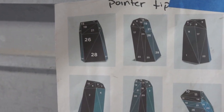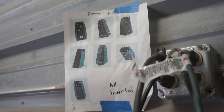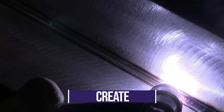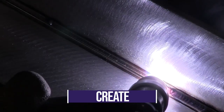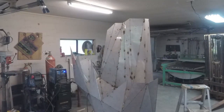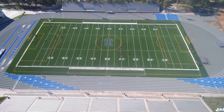500 triangles was still a lot, and we had to put them all together like a puzzle — there was no time for guessing where a piece fit. To keep everything organized, we gave each piece of our model its own number. We turned the model into a full-scale digital pattern and programmed a CNC plasma laser machine to cut each piece from stainless steel. We used welding guns and torches to fuse each piece to the next. It started with a finger and slowly grew to a palm. The massive wrist and arm pieces were last. It took over 1,000 feet of welds to assemble everything — imagine welding from an end zone to an end zone of a football field three times.